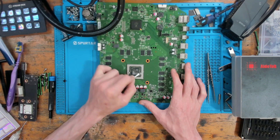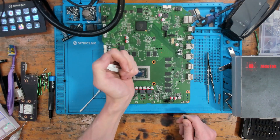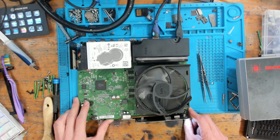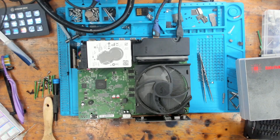Nice simple fix - cleaning the APU and getting rid of the old thermal paste, adding some fresh MX4. Moment of truth - boom, she's working! What about that bad capacitor? It's fine, it's not shorted. Unfortunately that crashed the capture card but just logging into the console anyway.